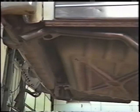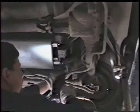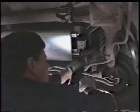We're going to come back underneath and get our air wrench. Gonna bring our air wrench in. Remember, we talked about getting that clamp to the back side of that so that it tightens up properly. We want this clamp level. We want to make sure it's missing everything: the gas tank, up over the housing, it is missing everything. A little bit on one side, a little bit more on the other. Finish cinching it. You have the one half of the system completely installed.